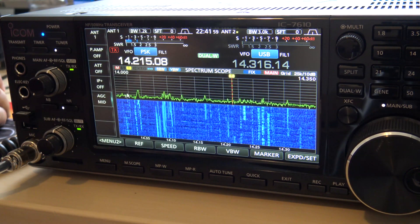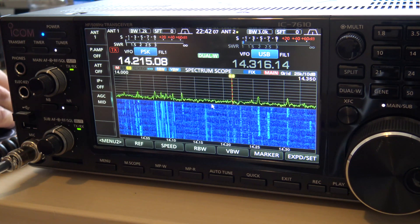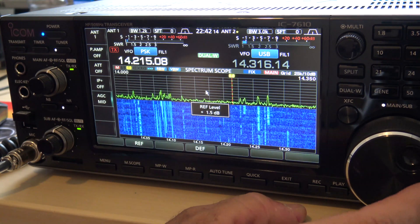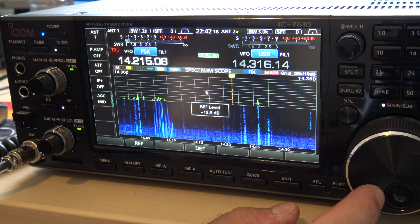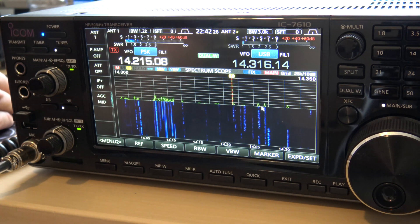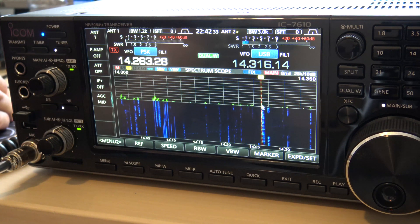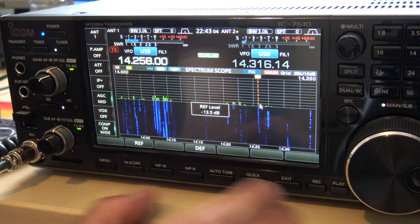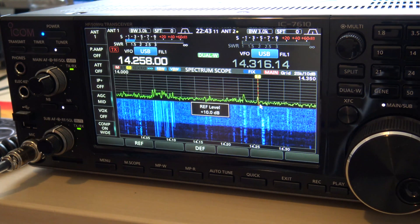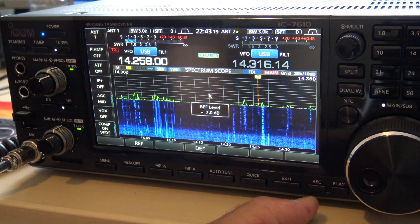What do I see? Down here I see CW signals. Here I see FT8, JT65, FT4. Up here I see phone. But maybe you have a lot of noise, or you really want to use this to find weak signals. So you can go here to reference and turn the reference down. Now what you're looking at is really only the signals that are standing out. You can turn the reference up a little bit if you'd like, but turning it all the way up puts your noise floor right there and it's hard to see. I take it down until the noise floor is gone and I only see active signals.